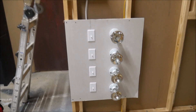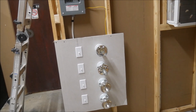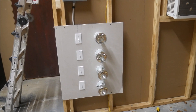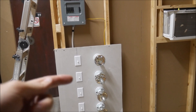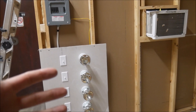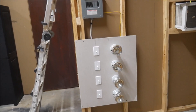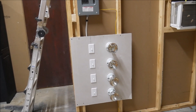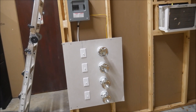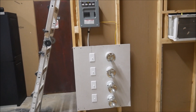The whole purpose of this setup is to be able to test the portable power banks that I get sent, and inverters and things like that. It gives me the ability to flip on one, two, three, or four of these lights for 250, 500, 750, or 1,000 watts respectively. Then I can run the portable power station and based on how long it runs, determine the capacity and whether it's properly rated or not.